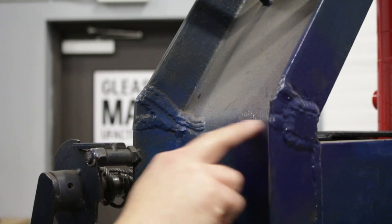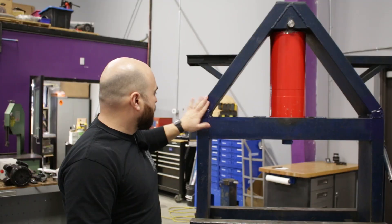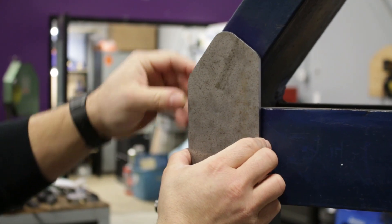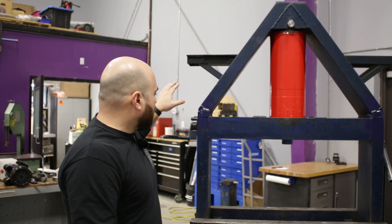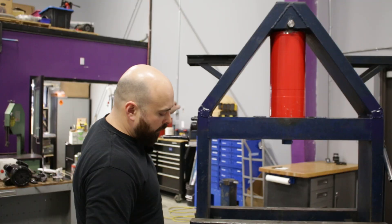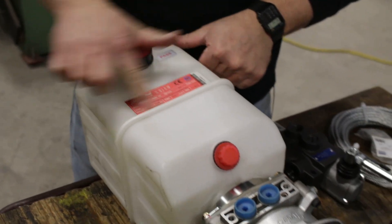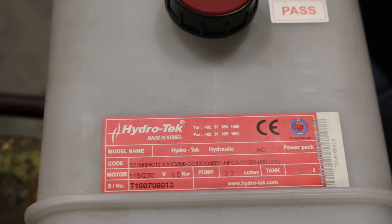Because this press has quite a few repairs on this joint specifically — right here where this is bent to make this shape — we're going to put larger fish plates on here that will substantially increase the strength of this joint. We're also going to replace the cable at the back, which is used for bringing the table up and down, and that looks frayed and in haggard shape. To power the cylinder we're using a hydraulic power pack — the tank has enough volume so I think it'll work perfectly. Let's get started.